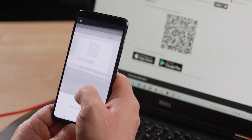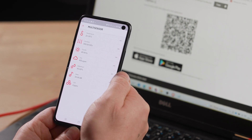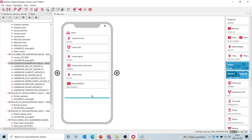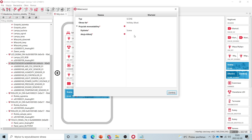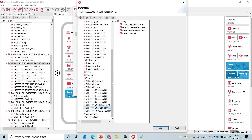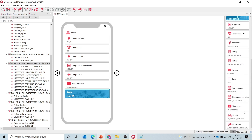Of course, you can also control any equipment previously configured from the IR controller level at the mobile interface level. We can move them in the form of separate buttons. By selecting any button on the right, we trigger the action in the same way as we previously configured the button in the touch panel — simply selecting the IR controller from the list and the code to send. You can also use ready-made widgets which we have prepared especially for controlling TV equipment, and configure this view to be as convenient as possible, fitting many devices in one mobile device.